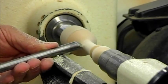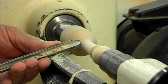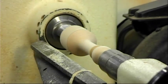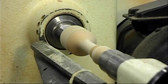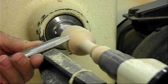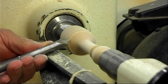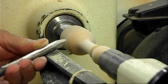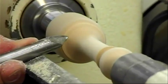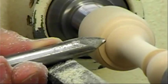You do want it to have a nice little bit of a feel to it. I like a little bit of a taper here. For an adult, if you want to go thinner, that's fine. Now I've got a little bit of room up here to play, so that's where I'm going to get my detailed spindle out and start going. And this is where you can use your artistic creativity. I like these grooves because in one of them, that's where I'm going to tie the string to the ball.